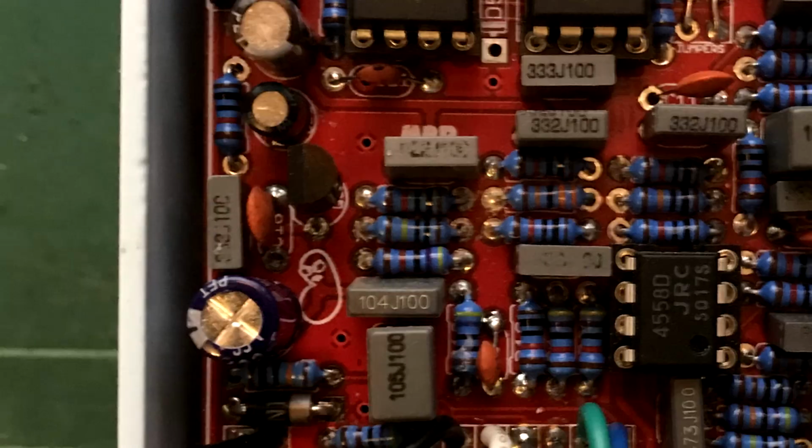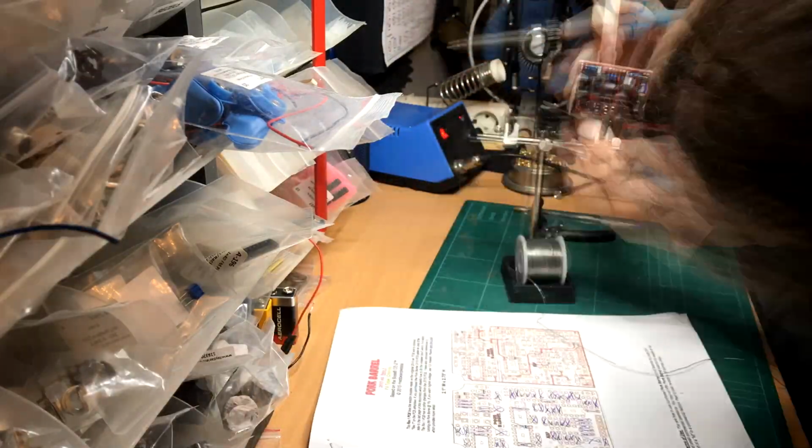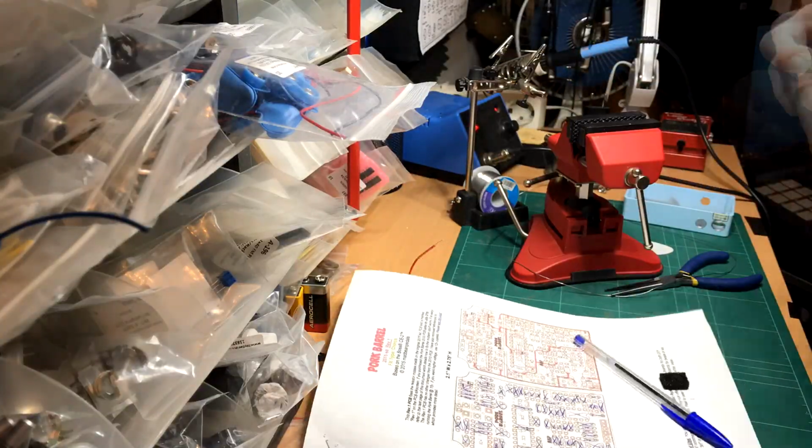In this case, I didn't have quite enough space to fully trim the lug on my 9-volt input, so I had to use some messy putty to kind of keep everything in place. I'd wager that had more to do with my drilling being somewhat off than the actual design though. Nothing but props on that.